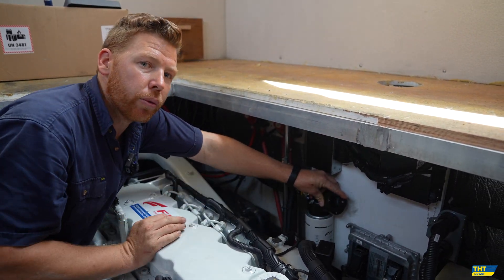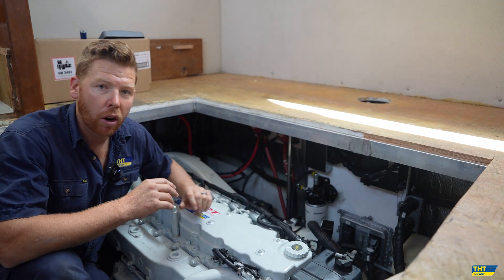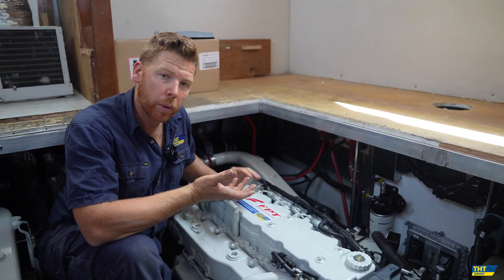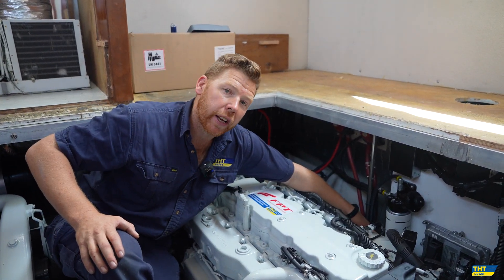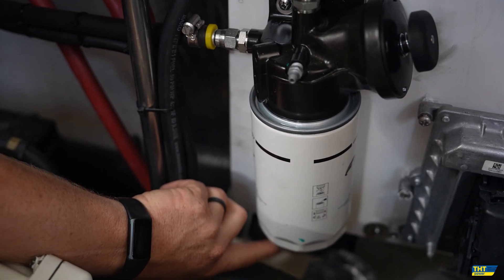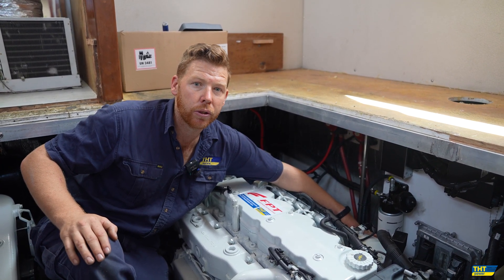Fuel condition is really important, so you always want to monitor to make sure that you don't end up with water in your fuel. That can be done in a couple of ways — ideally using a primary Racor filter or similar, which has a clear bowl at the bottom so you can see the fuel condition. Otherwise, make sure you're regularly draining the bottom of the FPT primary filter to remove any water, since water sits at the bottom of fuel. Do that on a weekly to monthly basis depending on how much you use your vessel.